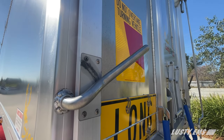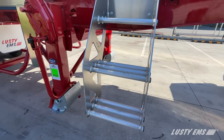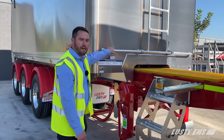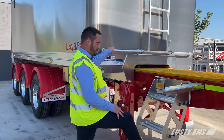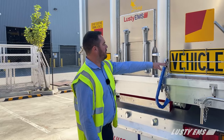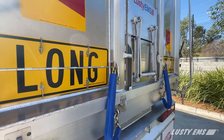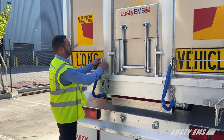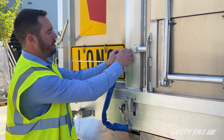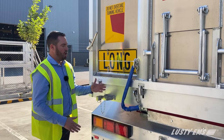One left, one right-hand side grain locks on the tailgate. There's an aluminium access step — you can gain access by grabbing onto the bottom ladder rung on the tag trailer and walking up the steps. The Stag tag has long vehicle signs on left-hand and right-hand, which are also road train long vehicle signs all in one. Spreader chains, if ever required for tipping off product when you don't need to open the tailgate all the way — simply put them in the holder and that will retain the tailgate to a certain opening distance.